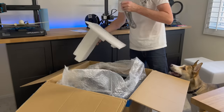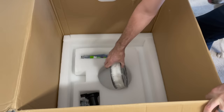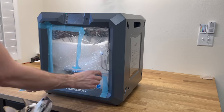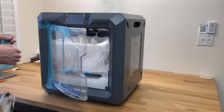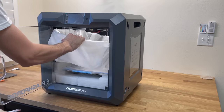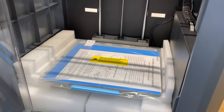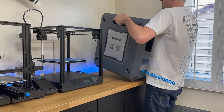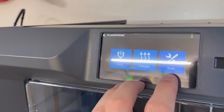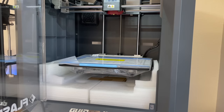Let me tell you — a couple weeks ago when I received the printer, it comes in a massive box but the entire printer is completely assembled. You just need to unbox it. It comes with an extra roll of PLA, a glue stick for adhesion, and the spool holder. There is a cover for this printer so you can print PETG or ABS. We'll take out the inside foam piece, plug it in, go to the Tools tab, go to the Move tab, and move the bed up.